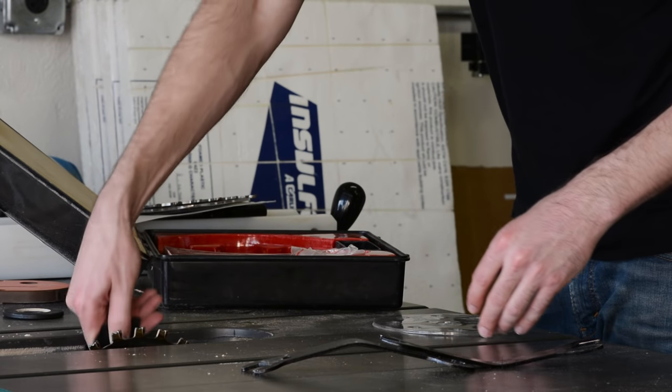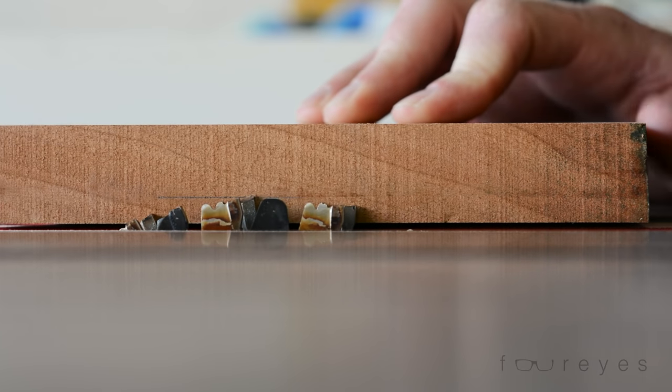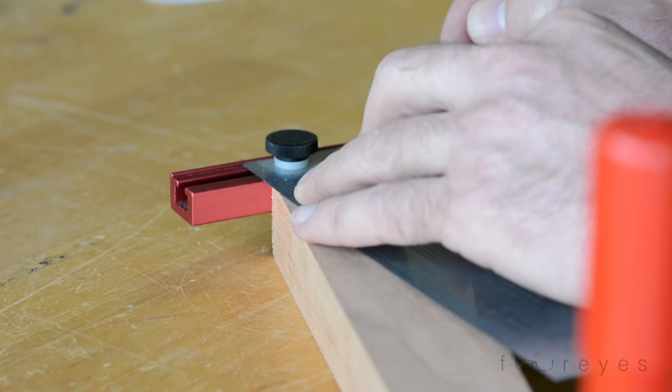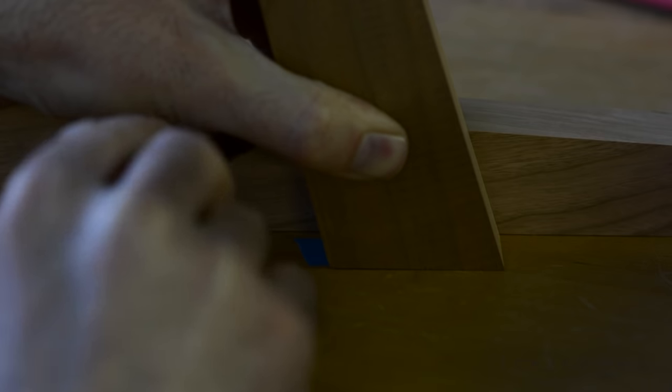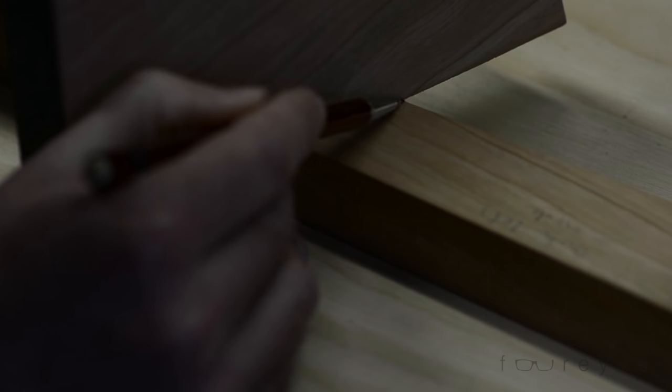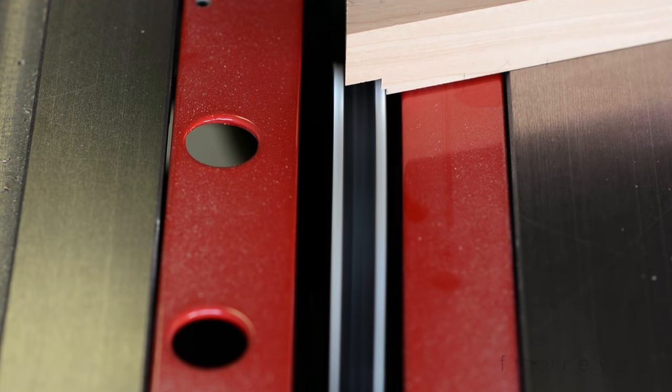Back to the legs — now that the shape is created, it was time to start cutting in some joinery. I went ahead and cut some dados for all the connector pieces that'll run between the front and back of the legs on either side. We know that the outside edge angles are 15 degrees, so I set up the dado blade, spent a bunch of time accurately marking out where all of my cuts needed to be, set my miter gauge at 15 degrees, and started nibbling away.